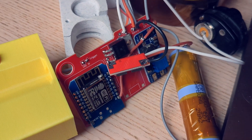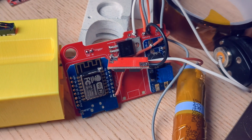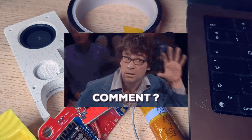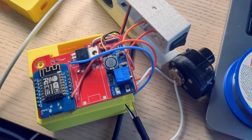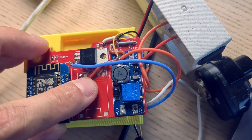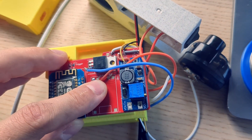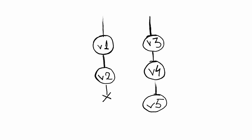So I don't really have a choice but to take out the charger module and just attach it to the battery somehow for charging. Next issue: the BMS seems not to want to open when it's placed after the MOSFET. I'm clueless as to why, but I'm sure there's a pretty logical explanation, so I moved it before the MOSFET. Remember when I said the PCB would clean everything up? Well, the next version will definitely be clean — so maybe subscribe for bass's sake.